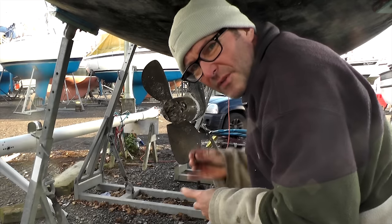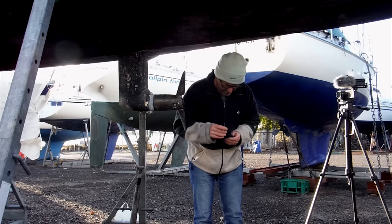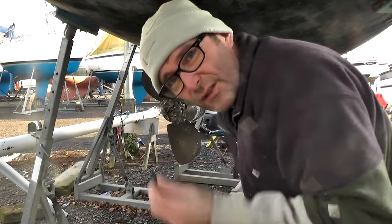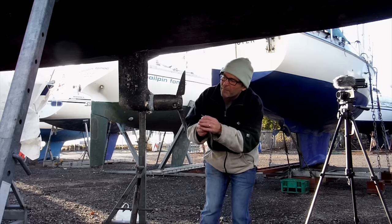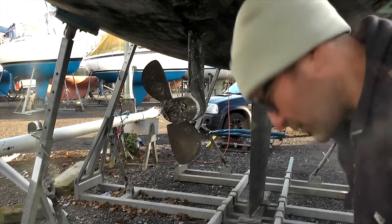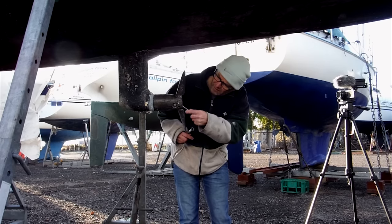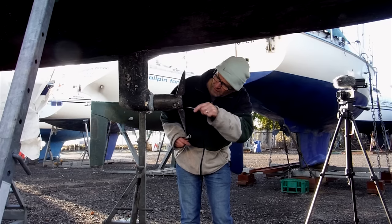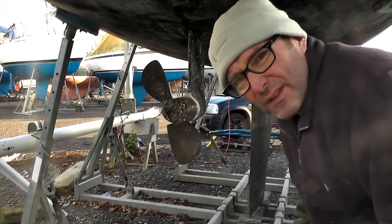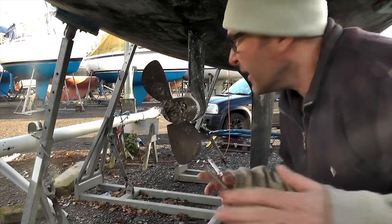The first thing I'll do is take the two grub screws out here, which will release the two pins and let me get the blades off. For reference it's a 6mm allen key. I'm going to get an old screwdriver to poke out the crud that's built up in the holes. I've decided to do this today because it's nice and sunny but freezing cold - about zero. The frost has thawed but it's dripping everywhere.